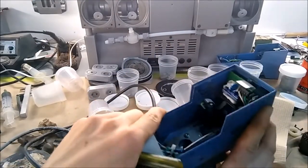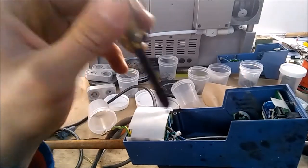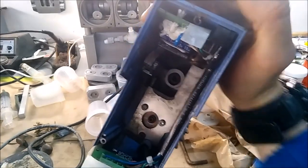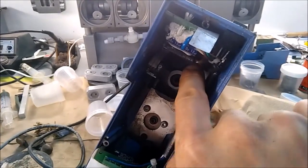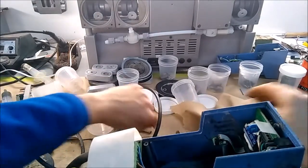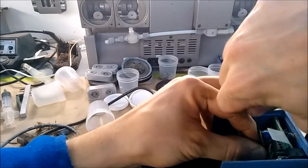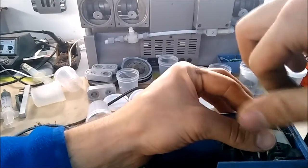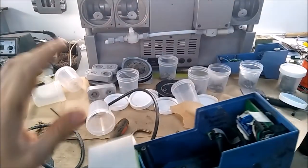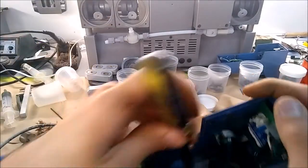Before I take the motor off, there's a little set screw on the spindle — I believe it's a 1mm screw and you just need a long Allen key. It's metric of course because it's German-made. Loosen that off and it lets you move the spindle out. Then just three screws come out and it comes apart really easily.